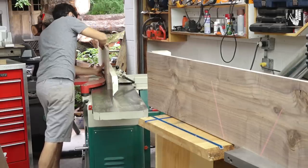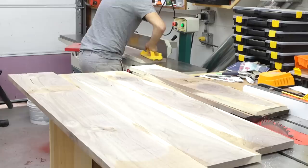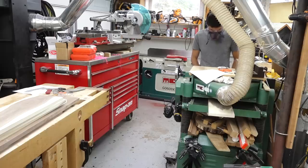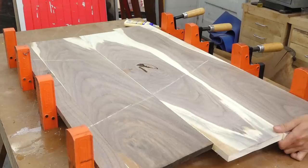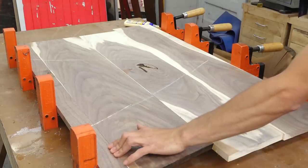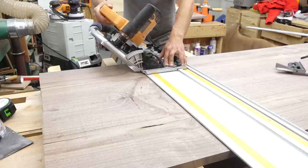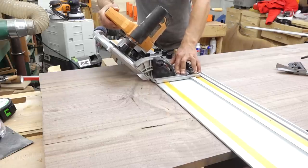To start things off, I'll make the panel which will become the sides and the top. While it's sitting in the clamps, I'll prep the material for the secondary panels. Only the front edge of these are going to be seen, so I can throw some sappy stuff together and just edge it with something nicer. Now I'll start on the waterfall joints — it'll make the grain appear to flow over the top and down the sides.